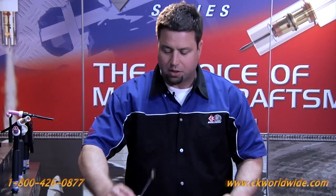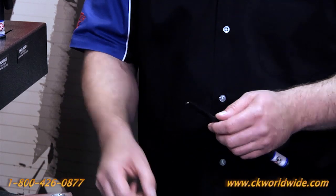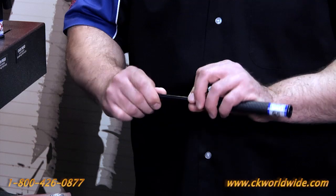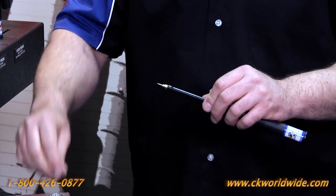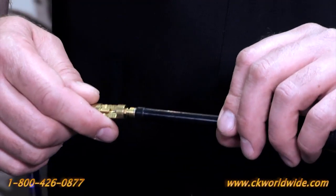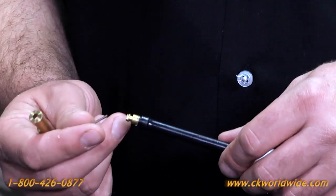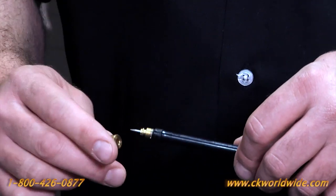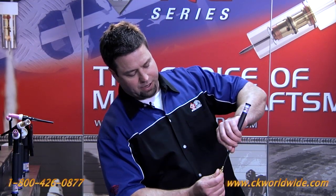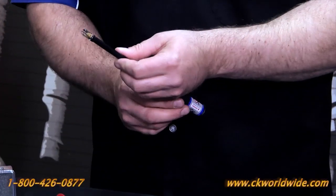The way this product works is pretty simple. You just unscrew the head and put the desired head back onto the neck of the torch, tighten it down, pull the nozzle off, take your tungsten stick-out gauge, and put it over the end of the collet tightener. You can release the electrode at that point, change out the collet, change out the electrode, re-tighten the electrode, and get the stick-out desired prior to welding.